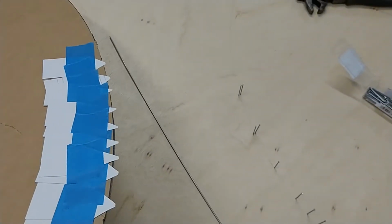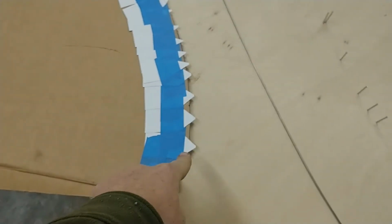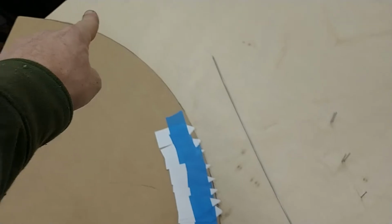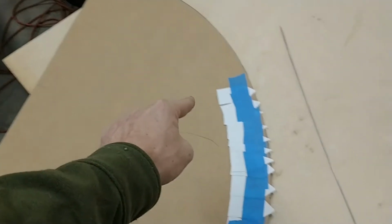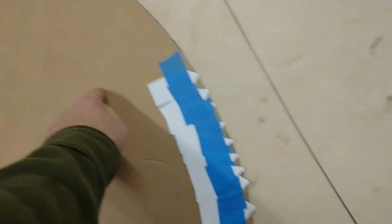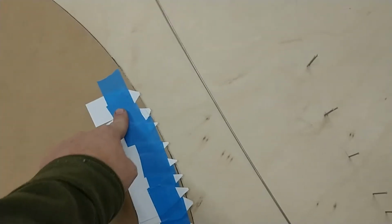Okay, boys and girls, the template that I hope you saw me making, if I didn't lose it, had all these little fingers on it. If I lost the clip, I'm not sure if I did or not, but anyways, the reason these are here was to help me get the curve, because for some reason on this back one, I was having a heck of a time getting it. You just cut out these little fingers, put this in place, tape it to hold it, slide these out till they touch, tape them, flip them around, make the little marks like you saw. Then put that back.